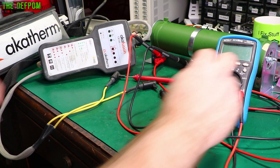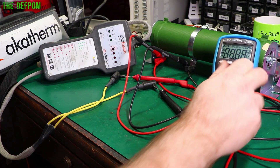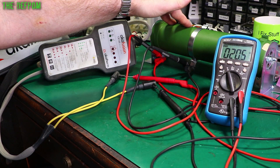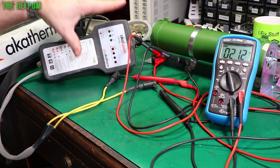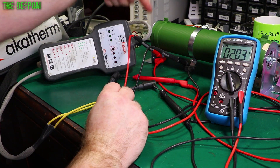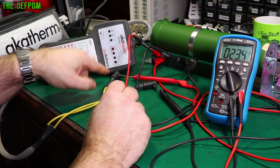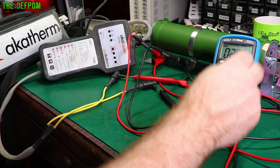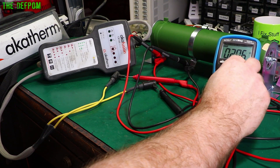Let's test this thing — I've got it hooked up. Let's do a verification first of the resistance. 20 ohms on my resistor here. Once I've got this thing powered up, then obviously no touchy — you touch that, it's 100 volts potentially. This end is 100 volts. So no touchy once I actually get the thing powered up. But that's the first verification — we have a resistor of about 20 ohms.